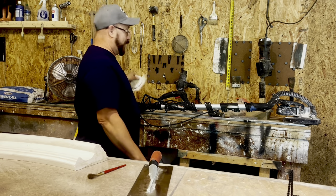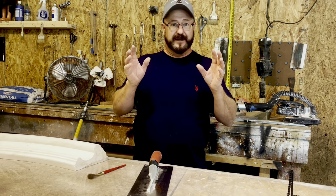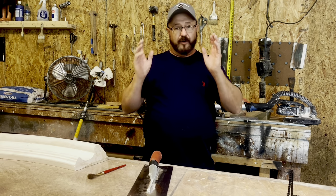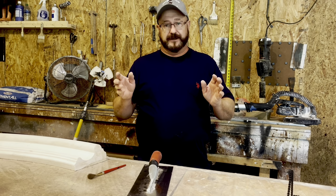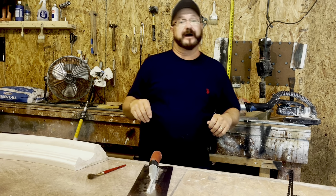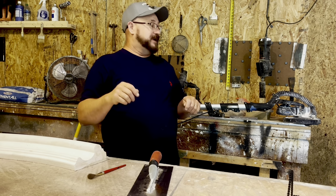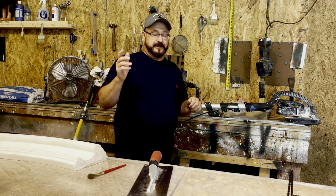They took drywall mud. This is important. They had taken drywall mud. About any time you see those kinds of textures, or a crow's foot, or the swirl, that was almost always drywall mud. Sometimes they used plaster, but that's generally done with drywall mud. They did it in the 70s, 80s, even 90s, maybe even in the 60s some. Well, I'm sure they did. But it was a drywall compound, which means it can be sanded. So that's what I want to touch on.